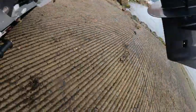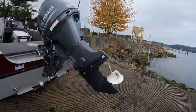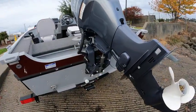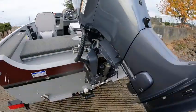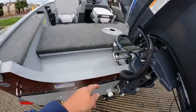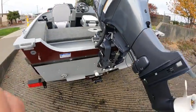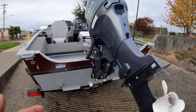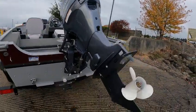Again, if your battery went dead, right in there — flathead counter-clockwise and it relieves the pressure on this trim pump so you can lift it up, then tighten it down and put it on these right here. Just say it happened — get some Corrosion X, spray it on this, don't grease this. Stuff will stick to it, water will stick to it and you'll have a frozen steering tube. Corrosion X prevents that. Same thing with spraying your motor down — once you're done, Corrosion X is a good idea.